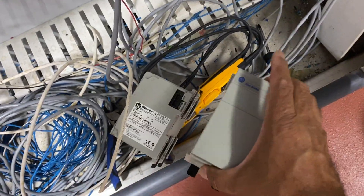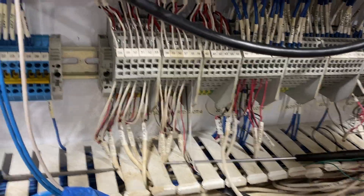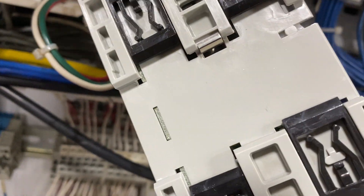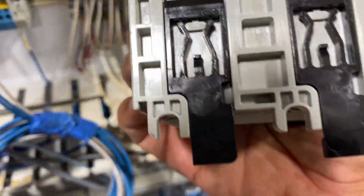I'm going to get the second one — make sure it's the same; I took it from another rack. Anytime you're going to push it back, you need to take this latch back up, otherwise it's going to lock and it will not go back to the DIN rail. So I take it back up right now.